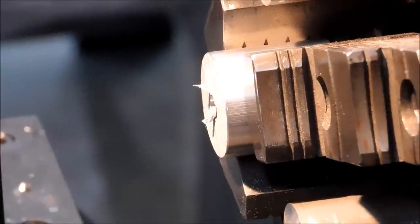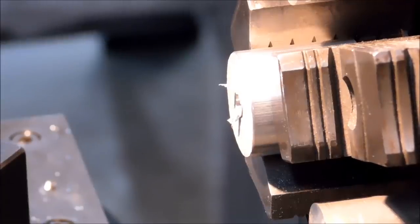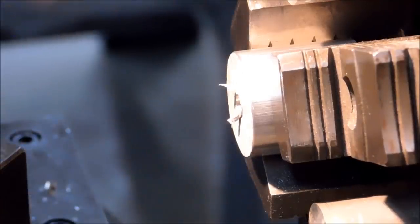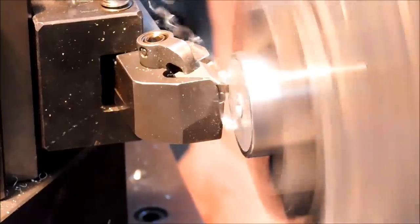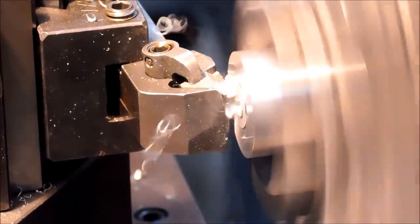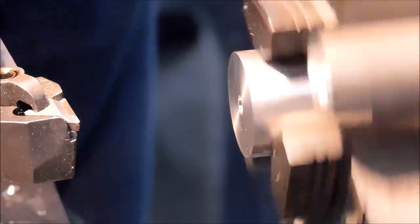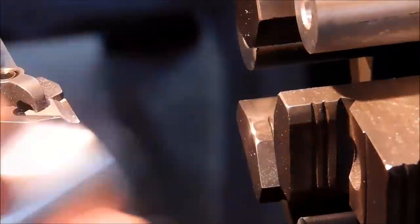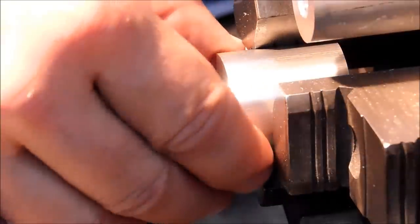Alright, knowing that this is just a test piece, I'm not going to get crazy. Everything here is cosmetic. Go for about an inch and a quarter long, about a 450 center raised rib with a reduced hub on either side, just strictly for appearance. Let's face it off, take a measurement. Got 72 more coming off.